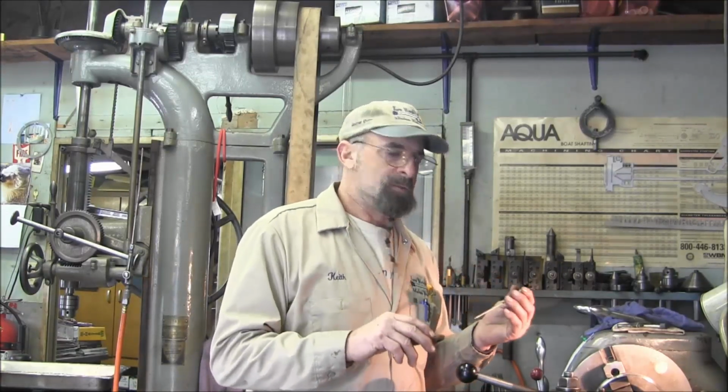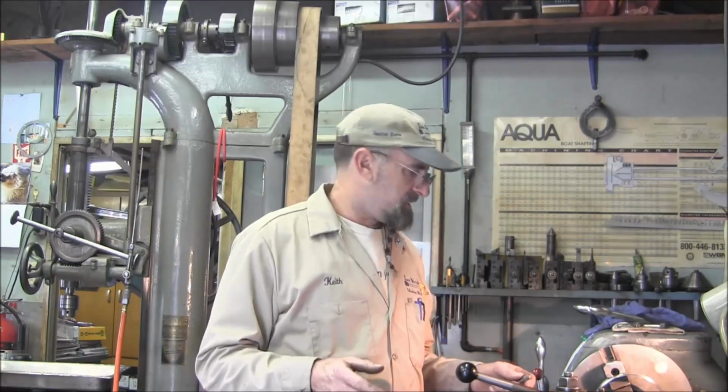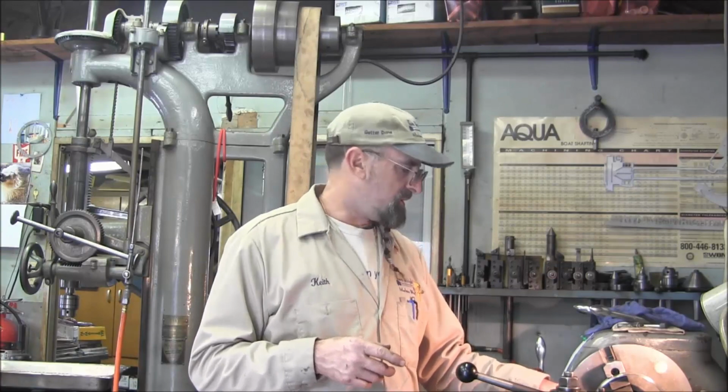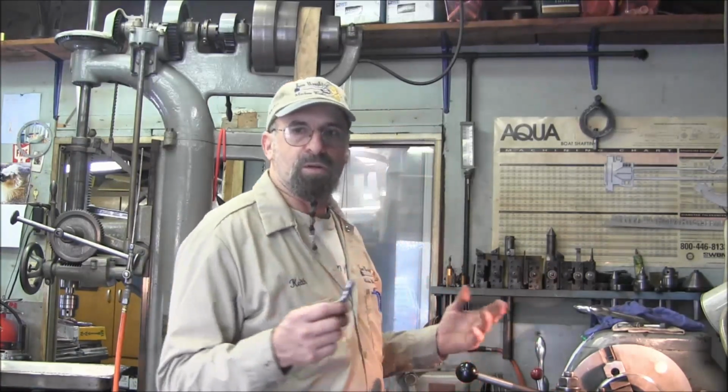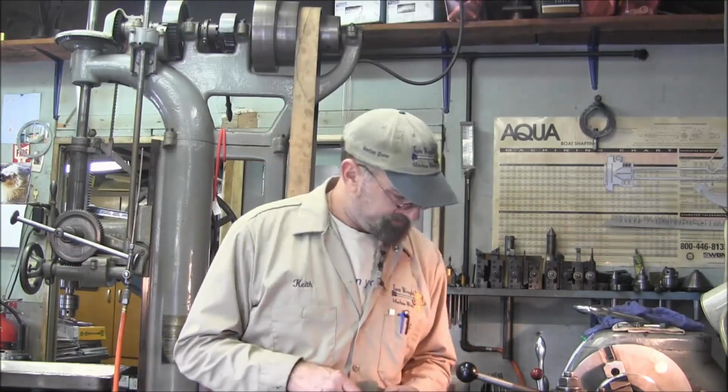So that's where you take down the dimensions, miking it up, writing those dimensions down, and then considering that your go-to figure for your amount of press fit. Don't pull the thing out and have it egg-shaped and then try to guess what it is. While it's being held round and it's turned true, that's when you go ahead and make your dimensions. So we're getting ready now, and I think we got another cut on this one here, and we're going to be switching it out to the next ring.